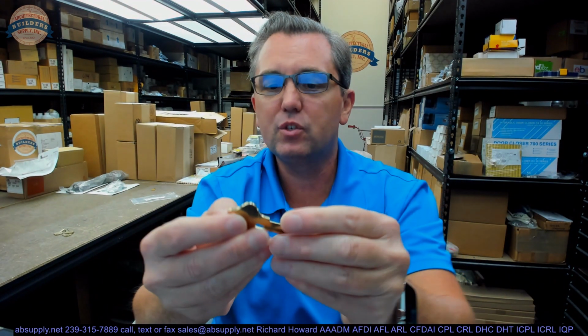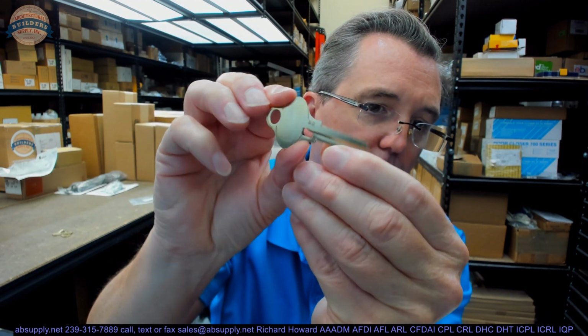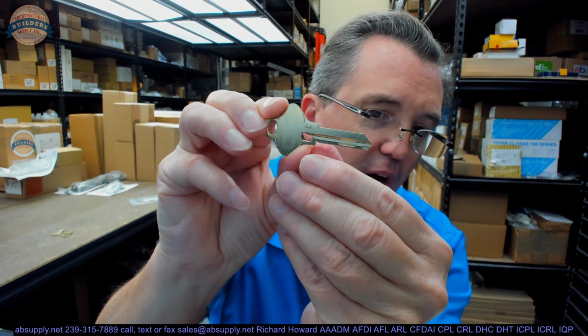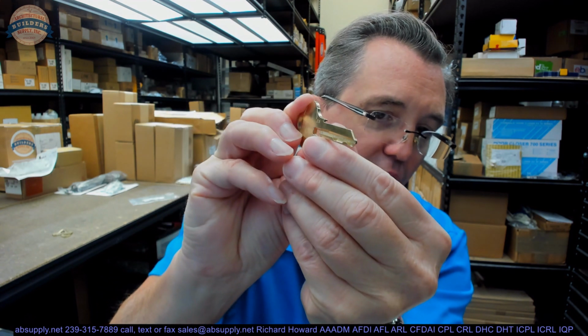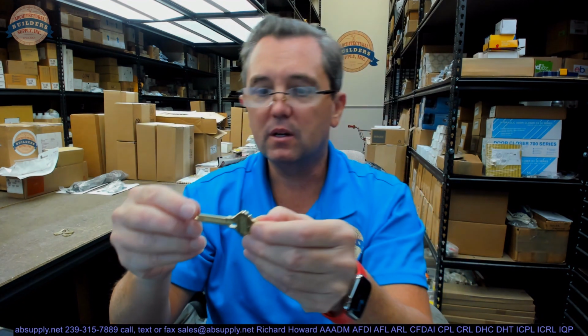So this is a 35-270. This is a typical key blank, and we're going to define what typical means. This is an S134 keyway, and on these Everest 29 blanks, yeah, they do have S134 stamped down there. Side bit undercut milling on the side. That's for the patented check pin that you're going to have with Everest. And that's what makes Everest Everest, the check pin.